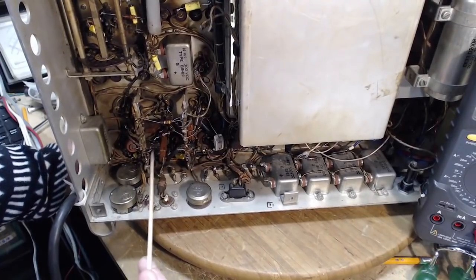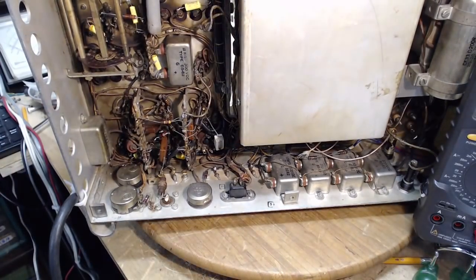So if we take this tube and we count the pins, oh my gosh, get more way out. I'm gonna switch to the other camera too. Here a little bit. Oh yeah, one of those is pin 6. Oh, there's numbers. Looks like I can see 8, 9 in the gap. So 6 would be there. I see some green powder. Looks like corrosion at the bottom of what must be pin 6.